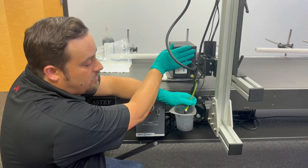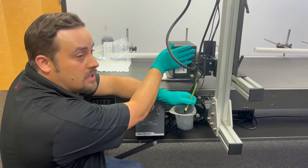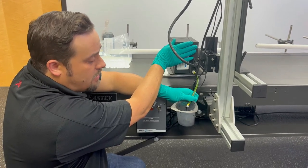We're looking to hold that down for about 30 to 40 seconds. The main thing we're looking for is to see clean fluids with little to no air bubbles coming out of it. We want a solid stream, which is what you're seeing right now.